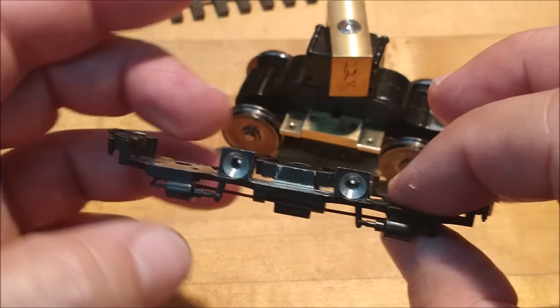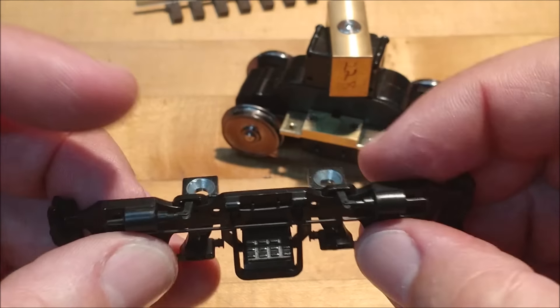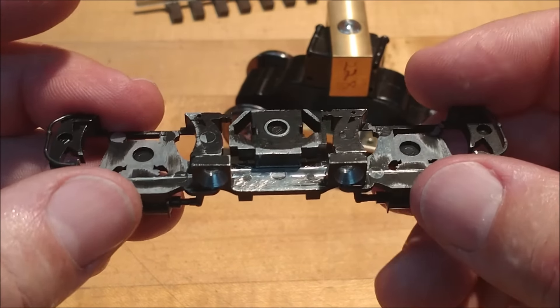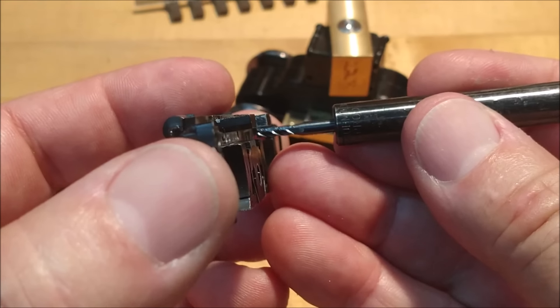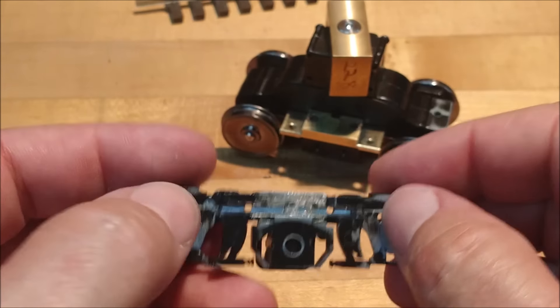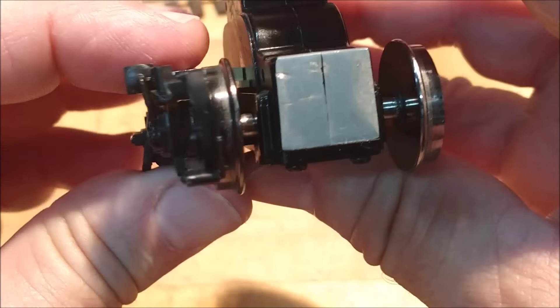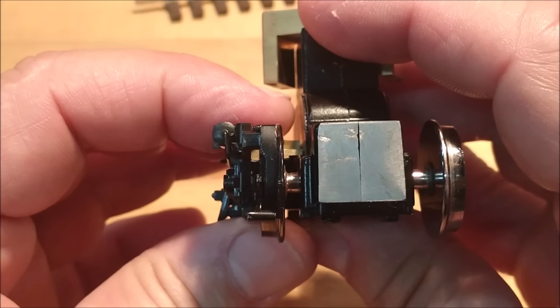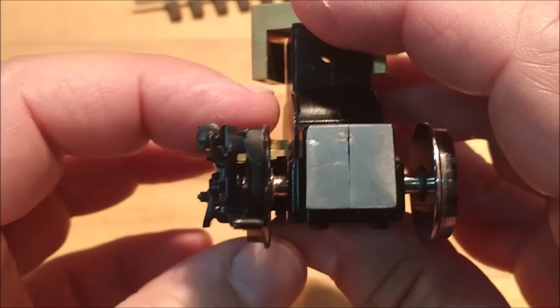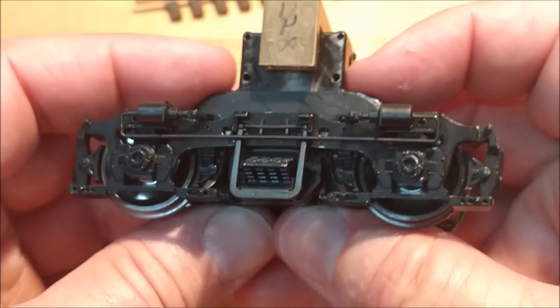After I've got my surfaces picked out, I'll visualize the fixture I need or the position in which I need to present the part. The part needs to be presented vertically for the drilling and countersinking of these holes, and horizontally so that I can run a very small end mill through here to assure that the contact surfaces being registered on this part are perpendicular to this face — so that when everything is torqued down, it stays true to the world. The last thing you want is this thing sitting at an angle or the wrong presentation. I want it parallel to the side — everything where it should be. That's very important to me and to my customer.